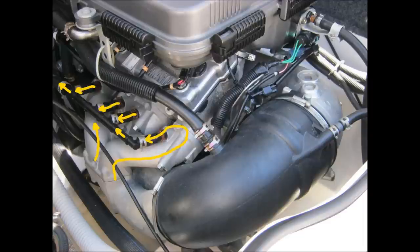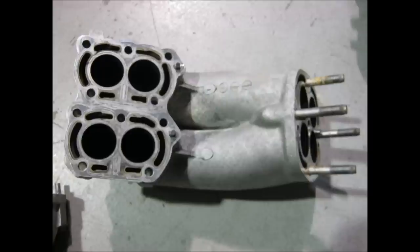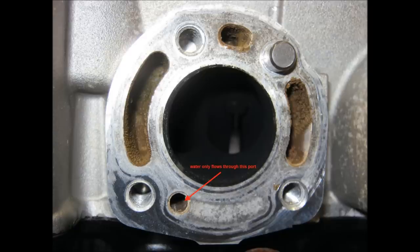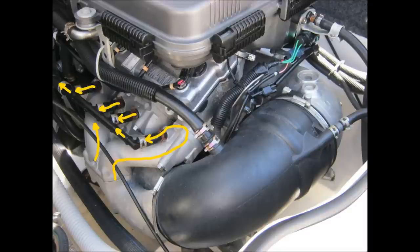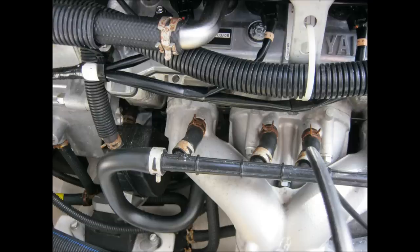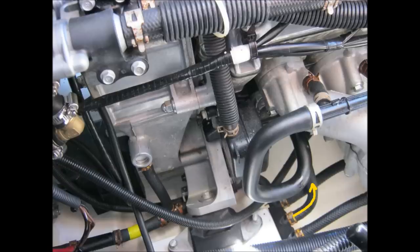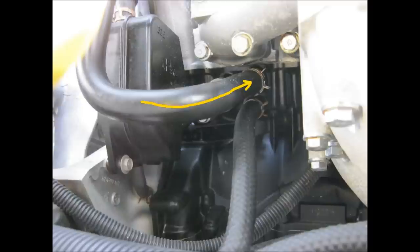Raw cooling water at the bottom of the exhaust manifold flows up into the exhaust header jackets. A small amount of water flows into the block through quarter-inch holes at each of the exhaust outlets. The rest deadheads against the block and is forced out the lines located on top of the headers, where a rubber hose carries it to the engine block. A restricted portion of raw cooling water also flows to the block at this same spot, probably to temper the heated water.